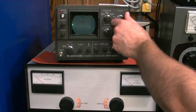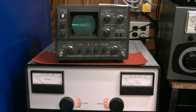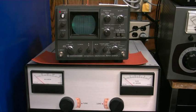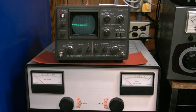Test 1, 2, 3, 4, 5. Hello test. Now we haven't got our amp keyed yet, but what we're going to be looking for here is maximum power out, which is indicated by how tall the waveform gets, and also best linearity, which is indicated by the straightness of the line on the trapezoidal waveform.